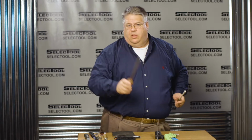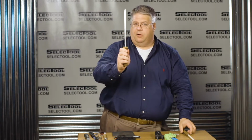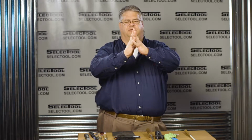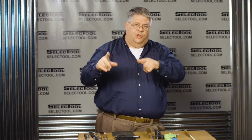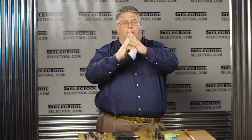But here's the issue, okay? And this is why, even though this and this look very similar, these are not abrasive, whereas these are. So if the edge wears, which is what it will do, and those little tiny teeth start to bend and fold over, what you want to do is straighten them back up over and over. They're resilient. They'll straighten back up if you use ceramic or the diamond hone. And you use that to remove the little metal on both sides.